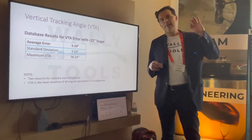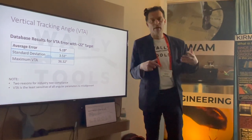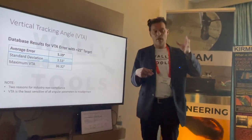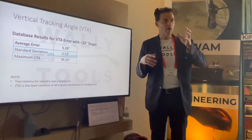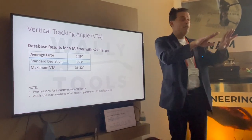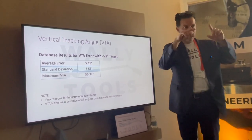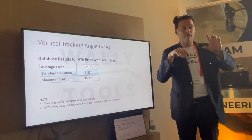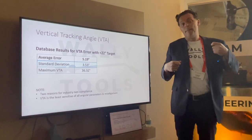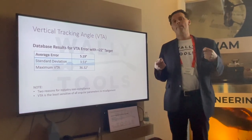One way to have more flexibility in cartridge design and to increase the output of your cartridge is to put one of the magnet structures, called the front yoke, in front of the coil former, not just behind the coil former. But in order to do that, you have to drill a hole through it. Many of you have cartridges like this. There's a hole through which the cantilever comes out. Well, that hole was made in the front yoke. That's magnetized. By having that yoke there, you're increasing the magnetic power of the magnetic flux field, which increases the output of the cartridge. Okay? But there's a cost.